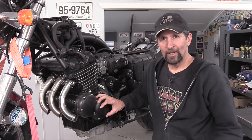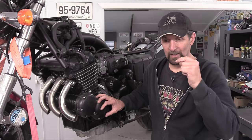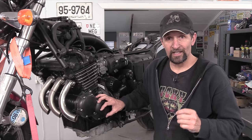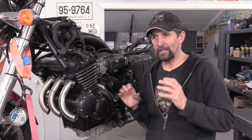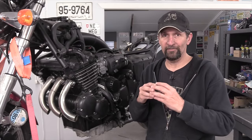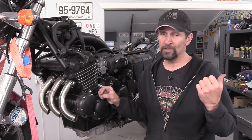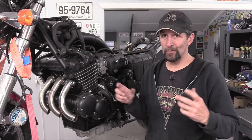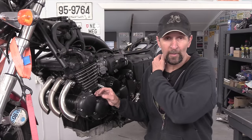Okay, there we are, a long old day, really enjoyed that and learned a great deal. I learned that I can tack weld that together very carefully, as long as I take my time, get the torch angle right and do a really careful job of it. You can see how strong they are. You just grind them off and those pipes are properly fused. Just grind off the welds afterwards and the pipe is still rock hard strong. As you saw, a sustained attack from a 2-pound hammer, all it did was dent it all over the place. No splits, no cracks, didn't break them apart. Fantastic. Very happy with that indeed.